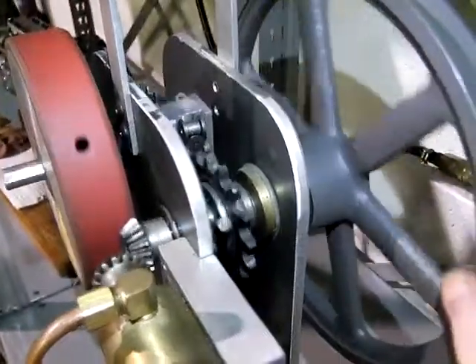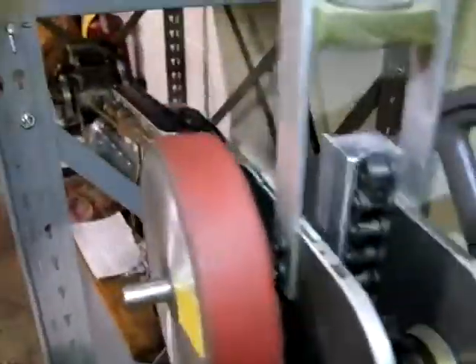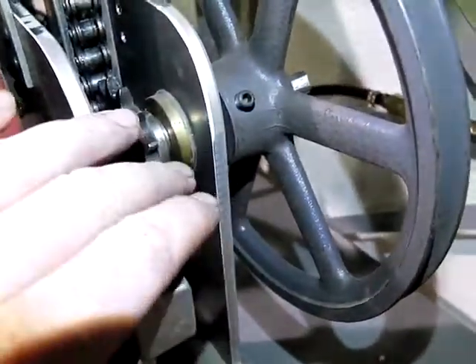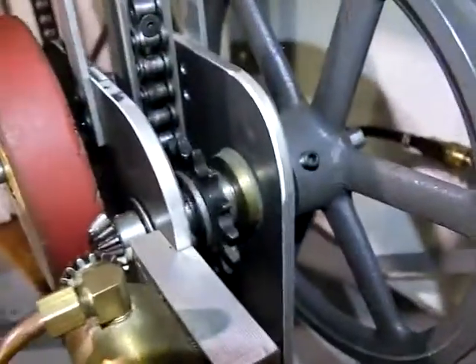Best I can explain it: if this piston is getting behind, it will start to run low and bottom out over here, allowing this to freewheel just enough. When it bottoms out and suddenly stops, this freewheel is just enough to advance this valve until it's operating just right.